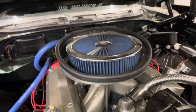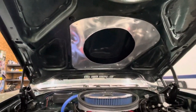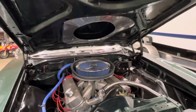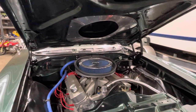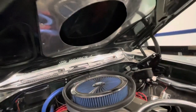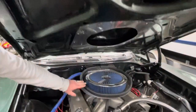They took some sheet metal — 26 gauge — something thick enough but still somewhat pliable, so it's not going to rattle and still looks good. Todd brought a nice cutting tool over to cut it. They put it in place, found the center, poked a hole, and then cut it with a lot of careful measurements to make sure it fit without forcing it.